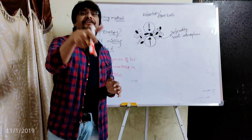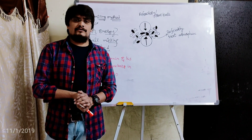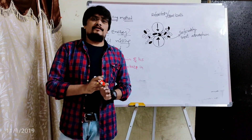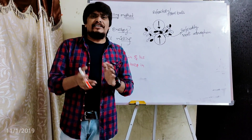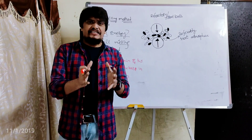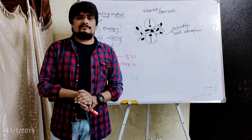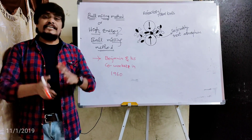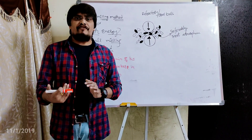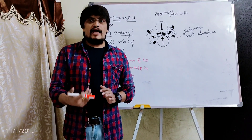The ingredients present in the machine are the steel balls and the bulk powder particles. Due to the friction, the temperature of the chamber or machine is raised, ranging between 100 to 200 degrees centigrade. Under these temperature and high energy conditions, the bulk powder particles are crushed into smaller sized particles in the range of 1 to 100 nanometers, and these materials are called nanomaterials.